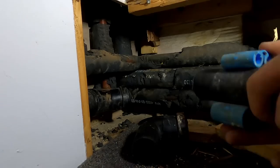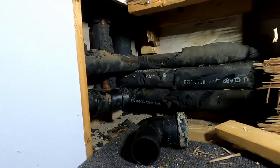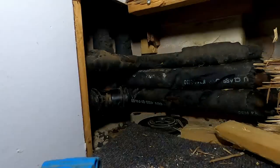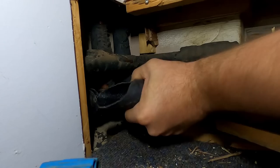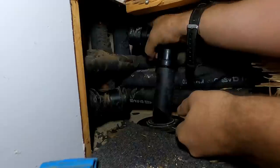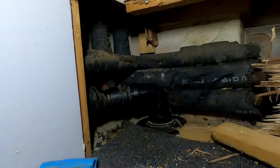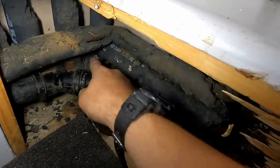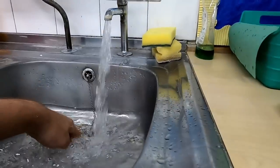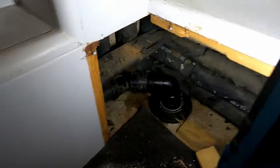This pipe will be fine — I just need a longer piece to go in between, so I'll just use the ox cutter. Turn it to be more low and then do a bit of a move with that. Round it there like that, and then that one into there, and that'll do us. Give that a go — you can see that rubber bung has virtually gone all the way in. I don't think you'll get any smells through that; it's just a tight drain. We'll give that a go, get some water down the drain and make sure it's all right. I know some people grease the O-rings on push-fits but I don't.